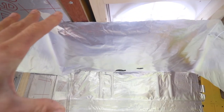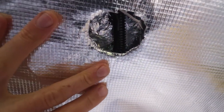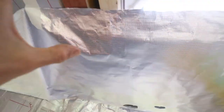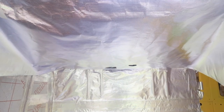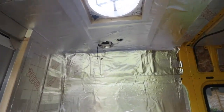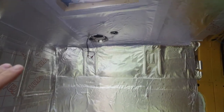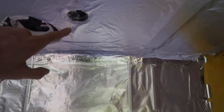I've now secured it to the roof and cut out the hole for the extractor fan, and that's where the light is going. I'm going to drop it down against the wall, spray the adhesive onto the back of the super foil and onto the roof, then get that into place. That was a success — the whole bathroom and toilet area is now sealed with vapor barrier, with cutouts for the roof vent and the light.